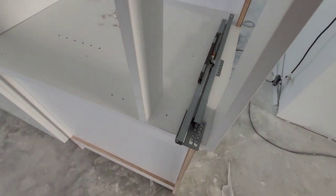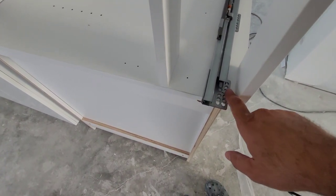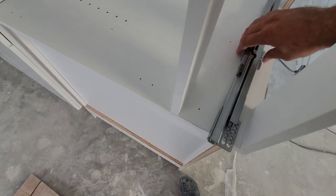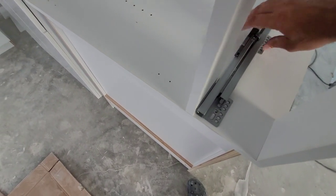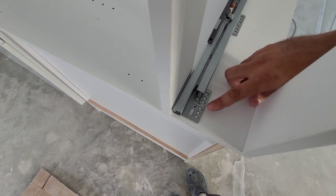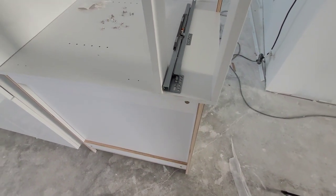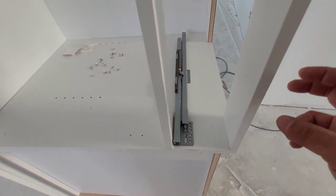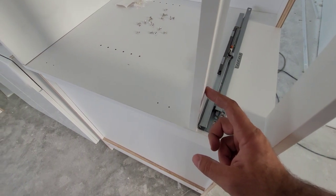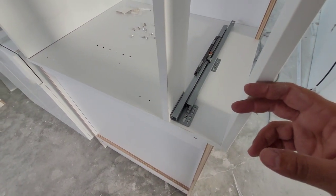The trickiest part was these hinges - this is what took me the longest on the first one. The instructions tell you to install them first but don't tell you which hole, what's front, what's back, what's up or down - just a very vague, crappy picture. It actually goes on the first row of holes, the second hole in, the first circle, not the oval. Put that screw in first, then slide the rail out and put the back screw - that's where they go. You're going to want to put the wood pieces on first, because if you put the rails on first it's sometimes hard to add the wood, so you'd have to loosen the rail, add the wood, tighten it, then tighten the rail. Just put all your wood on first, then put your rails on.